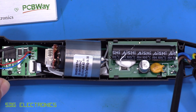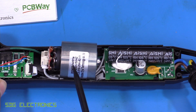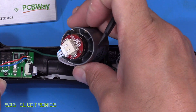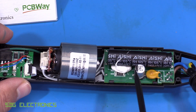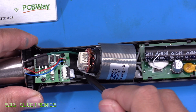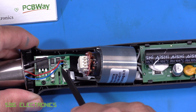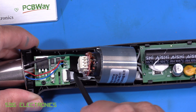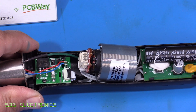Here's what the unit looks like inside. The mains comes in on the right-hand side into a bridge rectifier, and then there's a very large capacitor for the rectified mains voltage. We've got the high speed blower — rated 220–240V in this version — which is actually a three-phase motor with three windings: W, U, and V. There must be a motor controller on the PCB. On the other side we've got two thick mains wires and a flexi cable carrying control signals — thermocouple wires in red and blue, a triac for controlling the heating element, and a non-resettable mains fuse for gross faults.